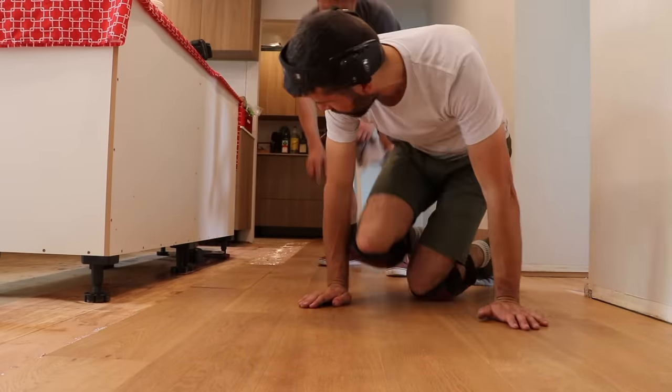This area is an example of why putting a floor on top of a floor was a good idea. This bathroom tile level is now pretty much level with our new floor and we've still got our little gap here. We're putting a brass plate over there and then it'll be flat. The carpet is also higher than the rest of the original floor, so adding this layer of flooring brings everything to the same level. Here's a tricky little area — we've got this little ripping in here. Put that approximately there, and then we want to get the shorty in here.